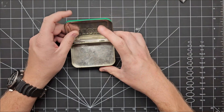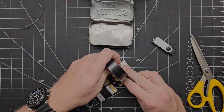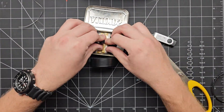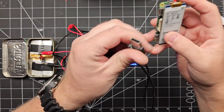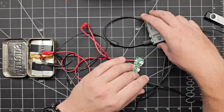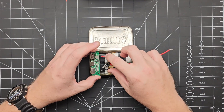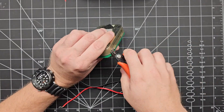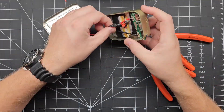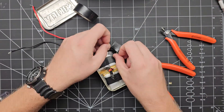I had one of my favorite DIY project cases lying around — a used Altoids tin. The next step was to solder all of the batteries together and then find a way to organize them and fit them inside of the Altoids tin. I did a dry test with the circuit board from the power bank to make sure it would work with those batteries and provide enough current to power the Pi. It did, and a quick check of the voltages showed everything was steady. Next I figured out how to fit the circuit board inside the tin — it was so close to fitting perfectly, but we had to hack up the tin a little to have part of the PCB hanging out. That's actually where the switch for the charge indicator lights is, so the lights will be on the outside of the tin so you can easily see the battery level.